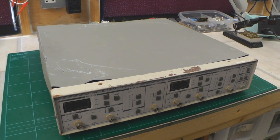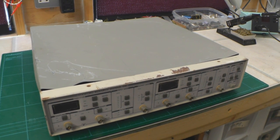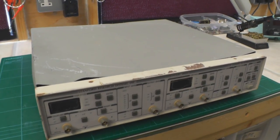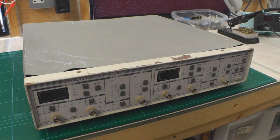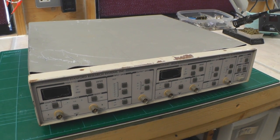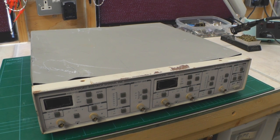So why did I get one of these? Actually it was off the back of the EEVblog where Dave bought a faulty one off eBay and got it up and running. It rang a little bell with me because during the design and build and testing of my own bench power supply, I was looking to get rid of some noise from the switch mode power supply, mucking about building little filters. When I saw Dave's video on the SR650 I thought, wow, it's exactly what I'm needing - a little programmable filter I can do high pass and low pass and build a little band pass filter out of it.